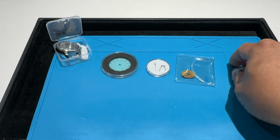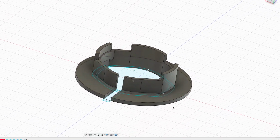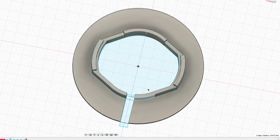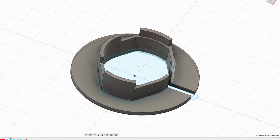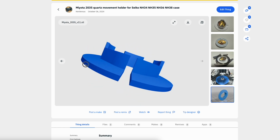To keep everything together, we need a movement holder or casing ring. For this build, I designed and created my own from scratch. I sketched it out in CAD software using the data specs from Miyota. Then I exported it to an STL and printed it with PETG filament. I'll leave a link to my STL design via Thingiverse in the description if you want to print your own